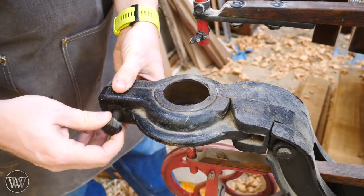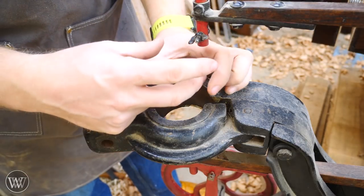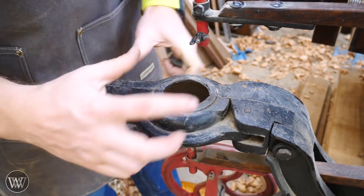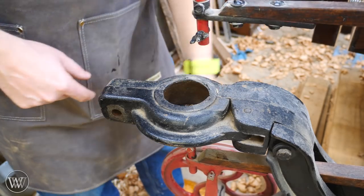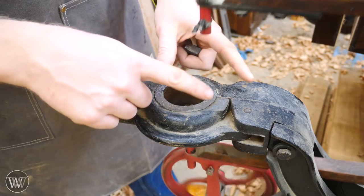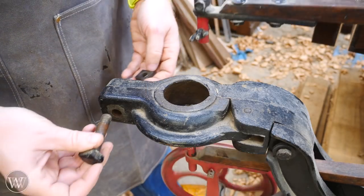The table mount here is really interesting. It's got a bolt that comes through here and basically a big ball socket inside that holds the table. You'd have a ball that fits in here and clamps down, which allows you to pivot the table to any angle you want, while still having a hole going through for the saw blade to run. I'm really interested to see if anyone has the original table so I can get an idea of what that ball joint and table looked like.